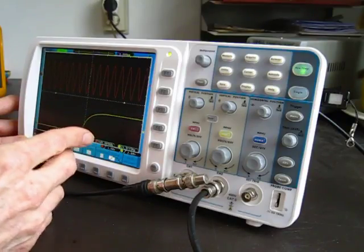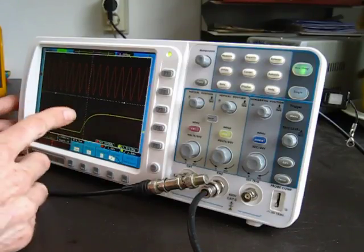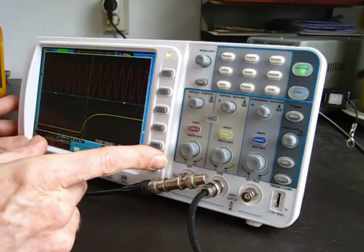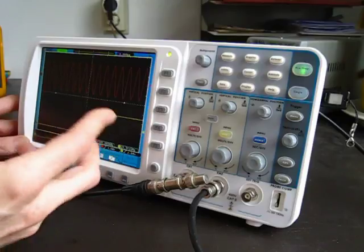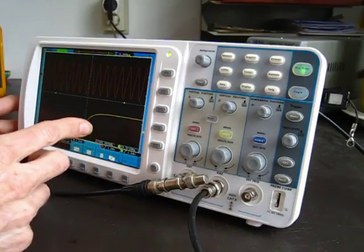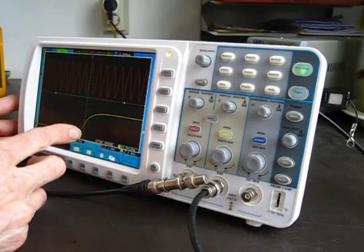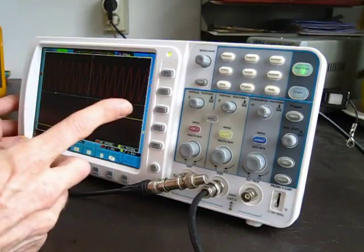It does work to the extent that if you have slow, irregular triggers coming in on channel 1, it will output a trigger out at the back, delayed by 1.5 milliseconds or so. But it does not output a correct synchronous trigger if your triggering input to channel 1 is much faster.